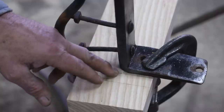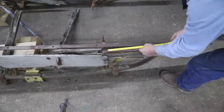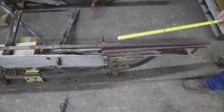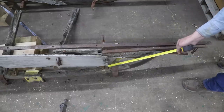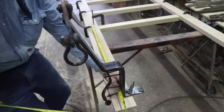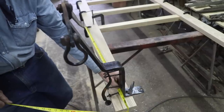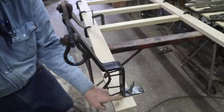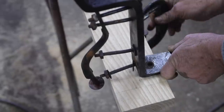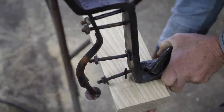Just not settled. So then I remembered there's a top iron here, so I went and measured that. If I measure from the center of this bolt to the end of the iron, I have 33 inches, end of this iron to the center of this cross frame where that bolt is going to line up with the brace on the rocker. So if I measure from the center of this cross frame where that bolt's going to be, and come up 33 inches, you see my end of the iron is going to be right here in the middle of this iron brace by 3/4 inch. So now I'm thinking this top iron has to be out flush with the end of this frame. So if I pull this out, it's pretty stiff. I'll see if I can get this pulled out here. Actually not a hair too far. So perhaps that's where it should be.